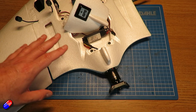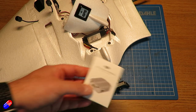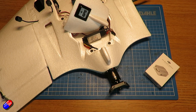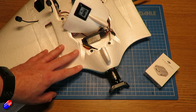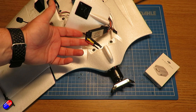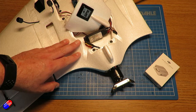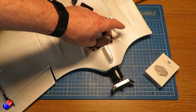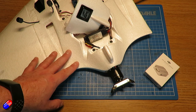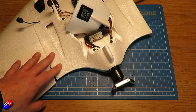Do you know where I went wrong? It was a silly mistake — I failed to complete my bench checks. As I got sucked into the issue with the DJI air unit and the onscreen display not working, I spent several days on that and got distracted. I forgot to go back and check that the motor-to-ESC connections were right. If you remember, the motor and ESC were pulled apart in the crash, and they weren't marked, so I didn't know which way to put them together. There's a 50-50 chance when you plug a motor into an ESC that it'll turn the right way — and the law of sod, I got it the wrong way around.